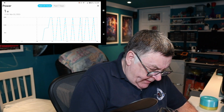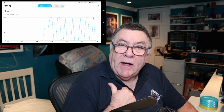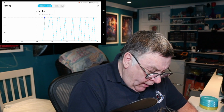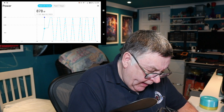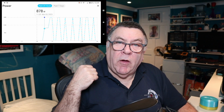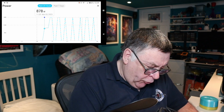So like I said, this is what I find fascinating. There, we're at the past 24 hours, and this is the power usage of the heater behind me. So if I click anywhere on these blue lines, if I click on that one there, at 11:20 on March 3rd, 2023, that's today, it was using 878 watts, because I just had the one switch on the heater. So with one switch, it's just like 1 kilowatt. It's a bit less watts when I'm running off the car because it's slightly reduced voltage. So it's only 800 watts.